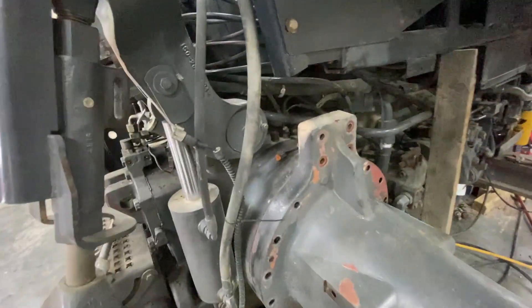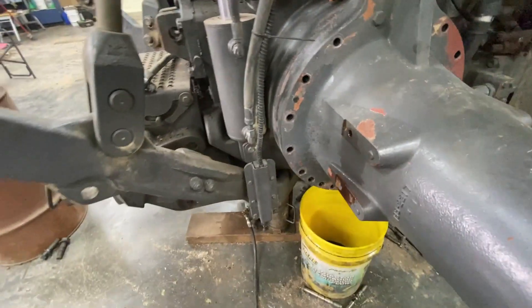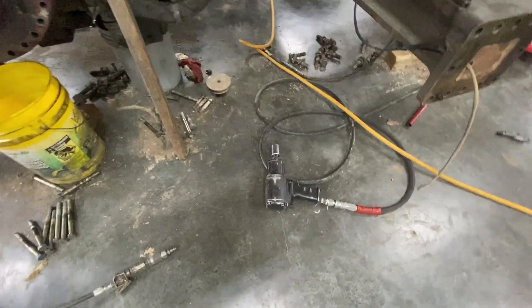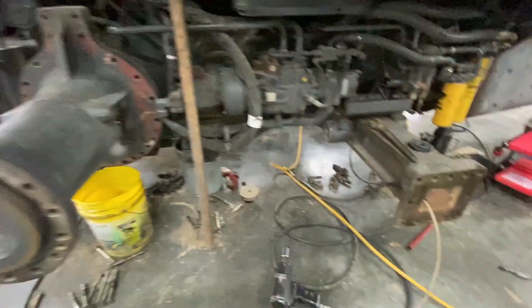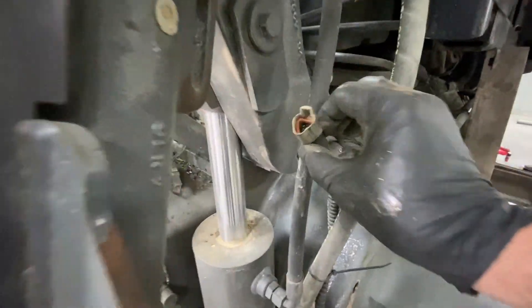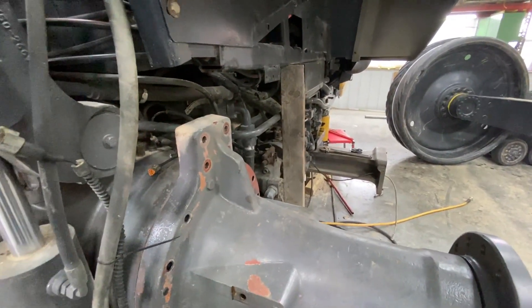Okay, so we got everything off. Shadow's got that cab mount off. We went around and loosened all the bolts on either side. We've supported the cab temporarily with a board and we've got a bucket for the oil. Here are the long bolts — we had to work with our gun and Shadow's gun, but it did it. Both of these come right off. Disconnect your sensor in your track. We got the sensor disconnected, and the three-point hitch was on the back. Now we're ready to support the casting and pull it off using chains.